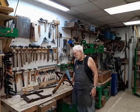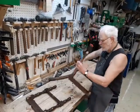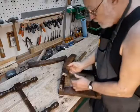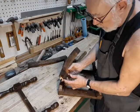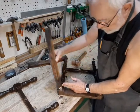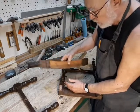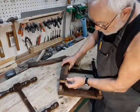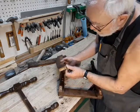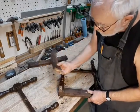Today we have to put this little vanity bench back together again. This is a fairly simple piece of furniture. All the corners are held together with dowel joints — they drill a hole in each piece, push in a couple of these little wooden pegs with a little glue and stick it together. The major weakness is that the dowels can break off, especially after the glue gives up the ghost and there's just too much leverage to keep it in one piece.